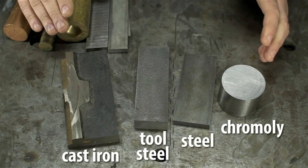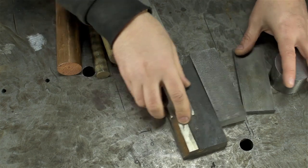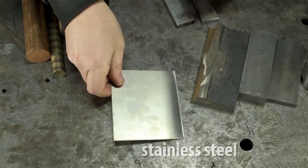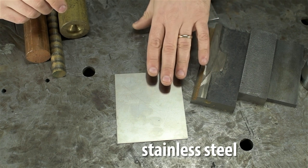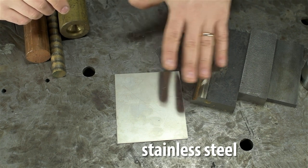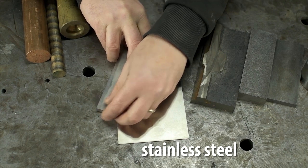If it's mostly steel, or iron I suppose, your basic DC TIG welder can weld it. Then there's stainless steel. That chemically fits in the same list, but people tend to call that out as different, so we'll do the same. In that family, you could perhaps also add nickel and nickel-based alloys like Inconel.